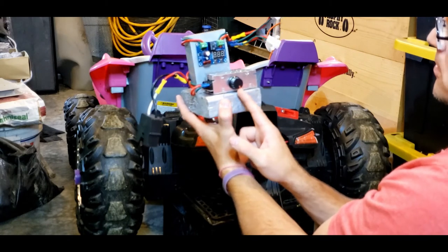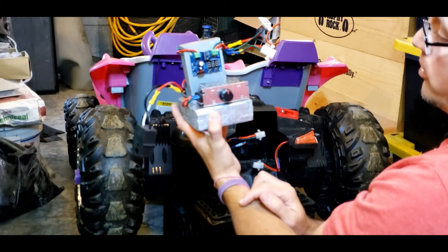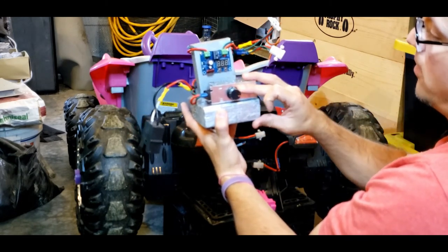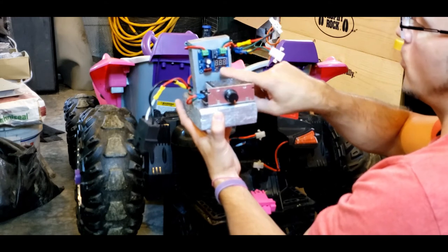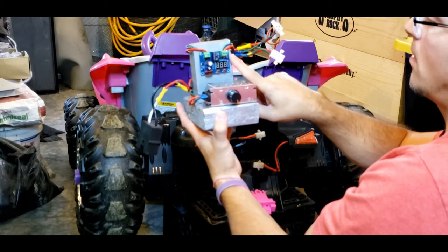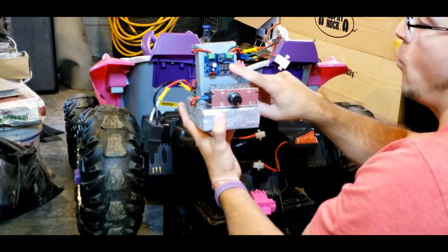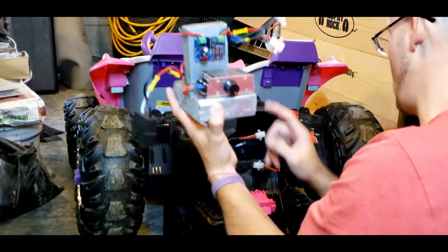This is what controls how much power we're giving it. This is full tilt. If you wanted to run this about the same as it was stock, you would just put your 18 volts to here, which is running you roughly about your 12 volts and keeping your speed exactly how it was. If you want to double the speed, you crank it all the way down and you're getting more than double power on this. These little buttons here will regulate how much your voltage is, how much your output goes, and you can set your limit. So you would set your limit so that when it hits 16, it will cut off power. And then I have it at 1 volt so that once it gets back up to 17, it can kick back on. That's how it regulates the board.